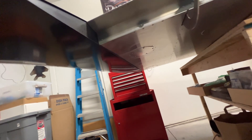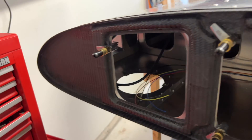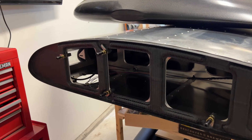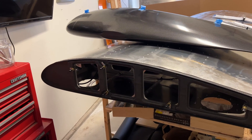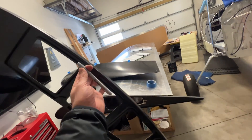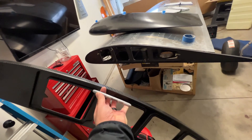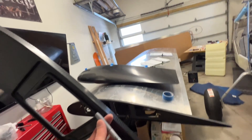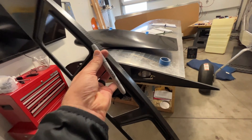It's kind of hard to see back where to drill, so I'll put a light and mirror in there. I'm going to walk the other rib over to the wing and mark it up with where the holes are, just so I have an idea of where to start looking — because there are about 12 holes in the rib, but only eight that you need to drill. We'll mark it up with a silver Sharpie and that'll get us going.